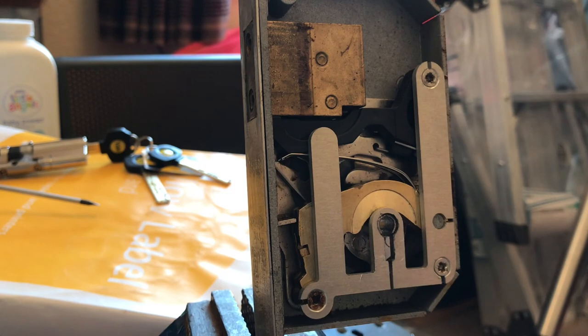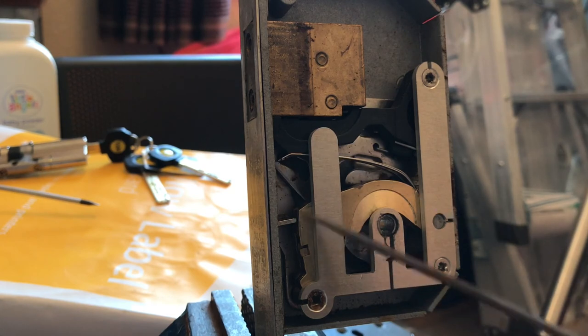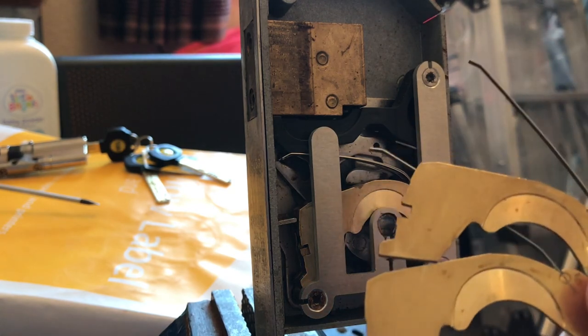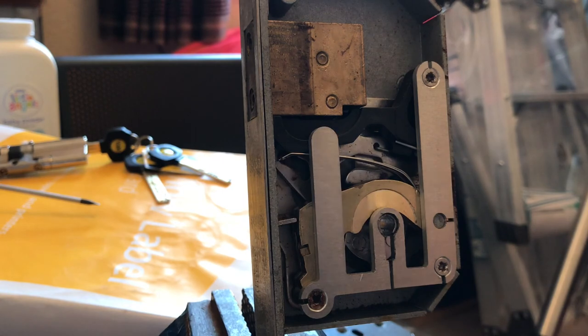I'm sorry it was such a long video, but I was picking this from scratch myself. You need to learn how to open these non-destructively. If you try to drill one of these locks in a door, there is absolutely no way you're drilling for the gates without doing serious damage. Learn your trade. Go on eBay, buy yourself a few old Chubb 3G110s or R35s - anything with a detainer - get a skeleton cover like this and keep changing the detainers and practicing. They can take up to 30-45 minutes to pick depending on the bitting, but once you get it done, there's absolutely no satisfaction like picking a 3G110 open.